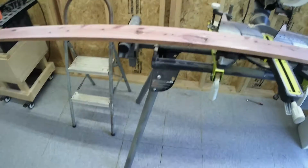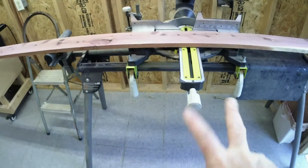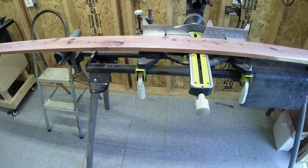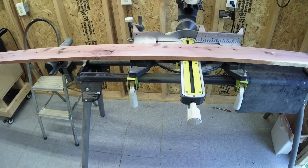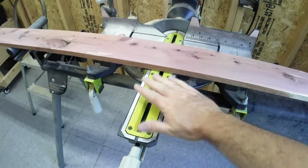It took me, I don't know, a good hour, because I had to clean out the planer. Whenever I was cranking it down, the gears that raise and lower it had a chunk from the cutting board I made in the previous videos. It got stuck up in there, and it was just not good. So I cleaned it all out, and now it's running perfect.